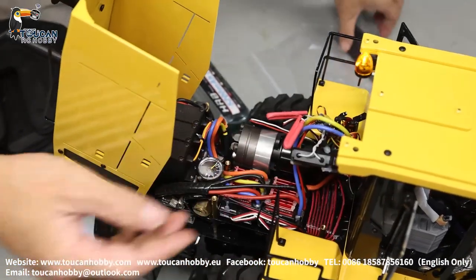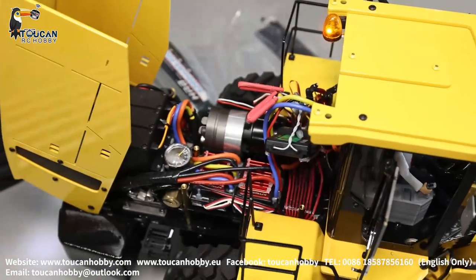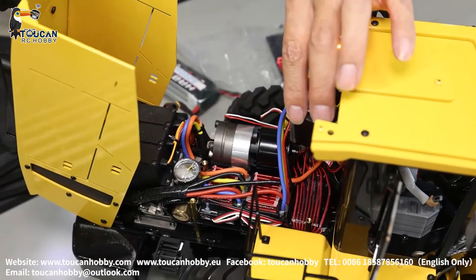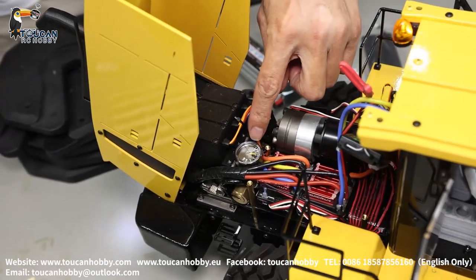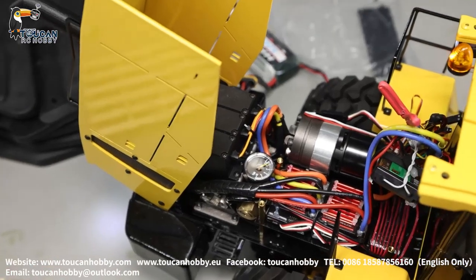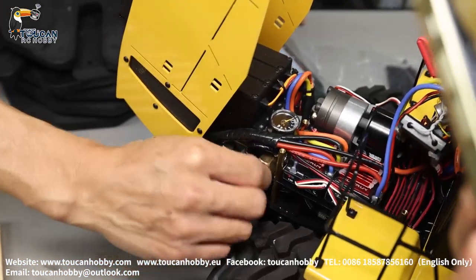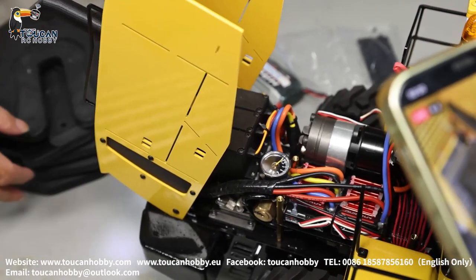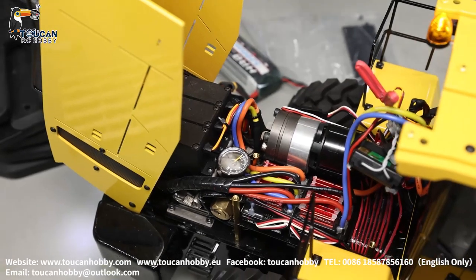I open it. In my other video, you can see I set up and changed the receiver with a Paladin EV radio for operation, only to show our customer how to get it done. So the pressure gauge, we can run it to show you. 4 MPa, almost 4 MPa. Here we have the pressure adjusting release valve. If you screw a little bit, you can increase the pressure, but that's enough. No need to risk bursting the oil hose. 4 MPa is enough for the operation.